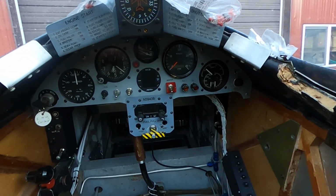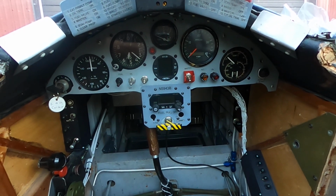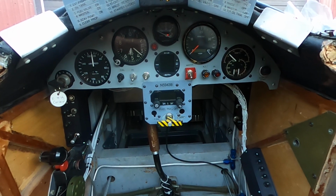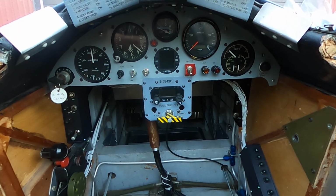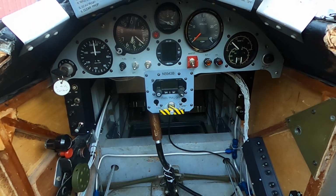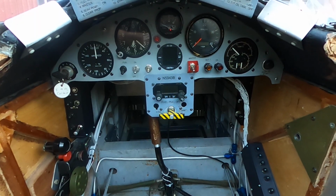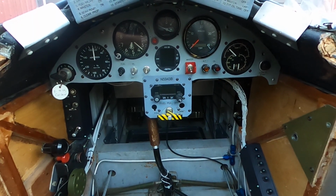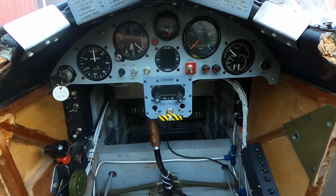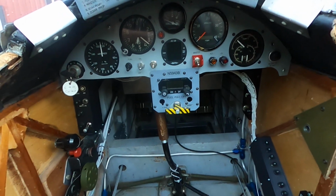I'm still working on it. I just finished a bunch of wiring cleanup on the inside. There was a bunch of, I don't know what to call it, scabbed together pieces from one point to the other. In general, in aviation, you're supposed to have no more than one splice. Well, this had like four in a couple different areas, so I went through and cleaned it all up.